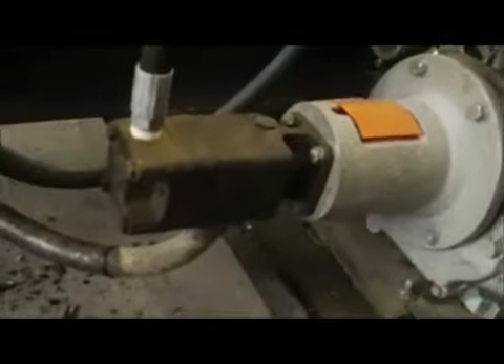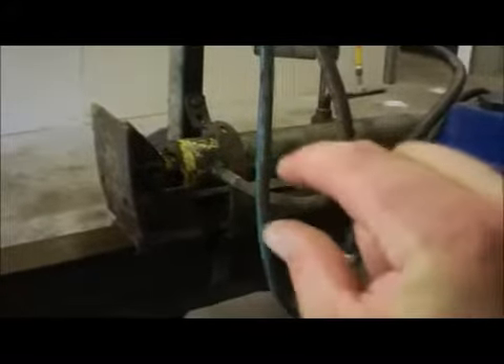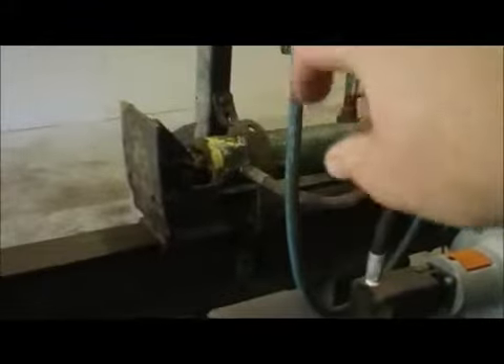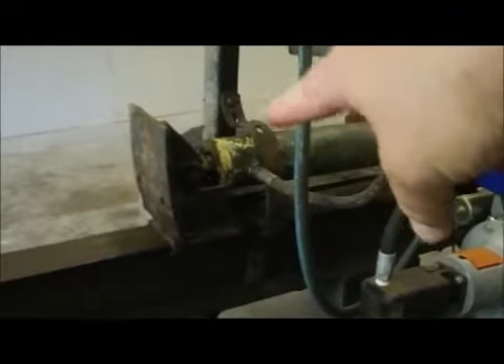It's a homemade build — they just got the pump hooked up to the back of the motor, and they got this cylinder hooked up back there with a pin, and it's floating and curved up and around, and slides back and forth on this I-beam. I don't know if that strap is for safety or what, but what I'm going to do is make a block that fits under there, get a U-bolt, put rubber under it, and bolt down the front of that cylinder because I don't like this cobbled mess.